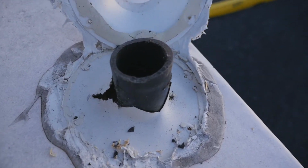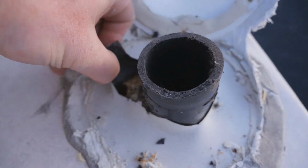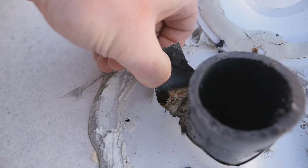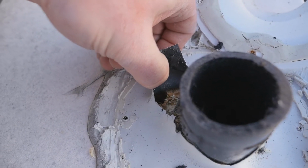And that's the vent itself. And I have a hole drilled right in here. The cables with the MC4 adapters on them aren't going to make it through, so I'm going to have to cut the MC4 adapters off, wire them through, and then connect new ones on the other side.